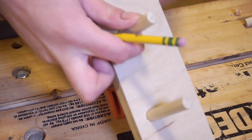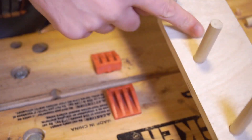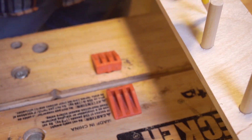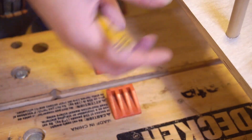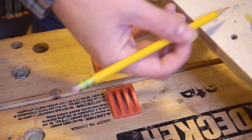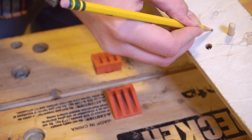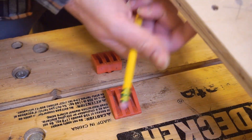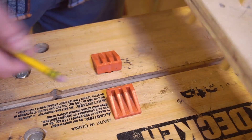In order to mount these shelves, the shelf is going to sit on top of this surface and I'd like to be able to mount it directly to the wall with a screw through it, but I'd like the screw not to hit any of the holes in the pegboard. On the back I've got four nearby holes marked out, so I know that if I put a dot right in the middle of them I can drill through there and locate the screw where it's going to sit best in the pegboard behind.